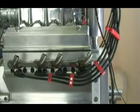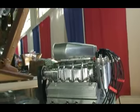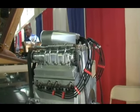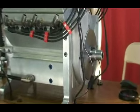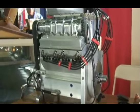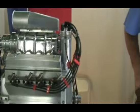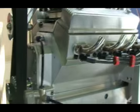It's pretty amazing, all the high-tech stuff that's out there these days. We had a guy that was just here, Jim Kipp. He just had his crankshafts done. We normally drill holes through them for oil holes, and it's very, very tricky and touchy to do that. Well, he found a guy that can sinker-drop them using an EDM machine. It electrically discharges and drills the holes and can make them stop wherever he needs them to stop. He did them with an electrical discharge machine. Just unbelievable. The stuff that's out there these days is pretty crazy.